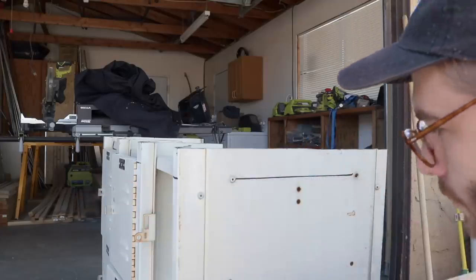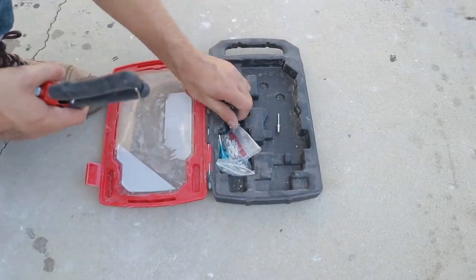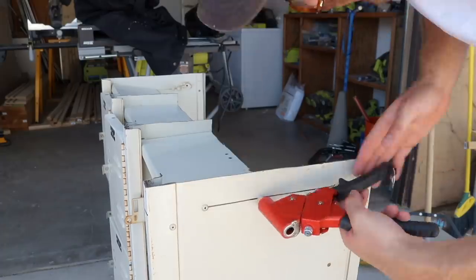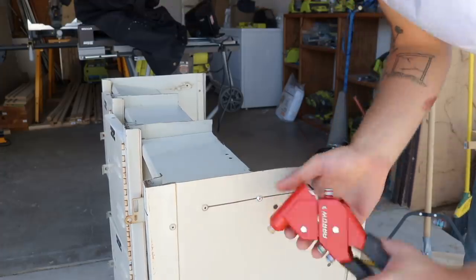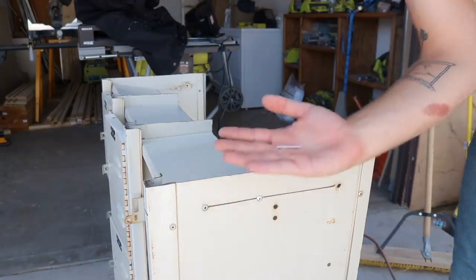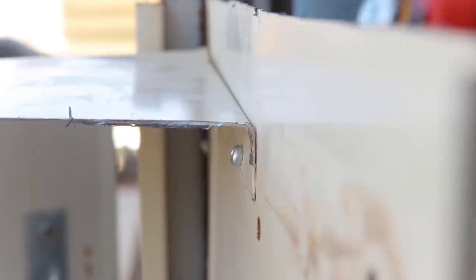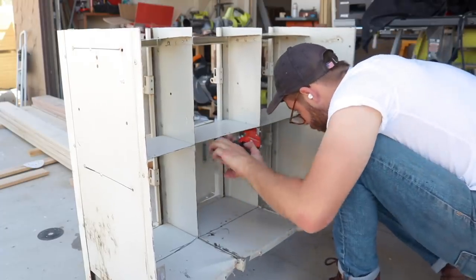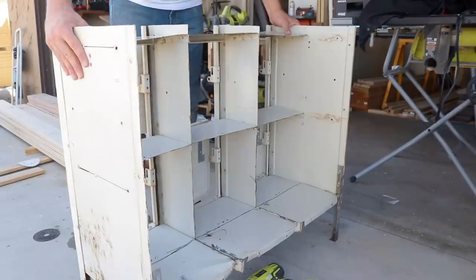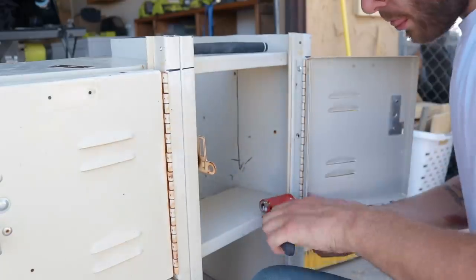It turned out pop rivets are super easy to install. After drilling a pilot hole with the drill bit from the case, I got the appropriate sized rivets and used the rivet gun to install them. You'll pump the handle about three times, maybe four, and that will make the rivet pop. Actually getting the drill and the bit into those corners was the hardest part. From my understanding, the force applied from the gun makes the metal in the back of the rivet expand until the stem pops off — hence, a pop rivet. I'll leave a link in the description to the rivet gun set that I bought from Home Depot for about $20.